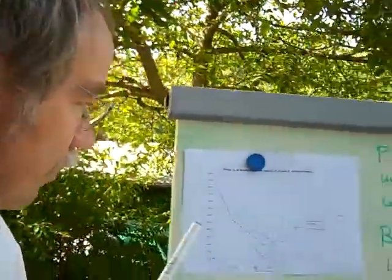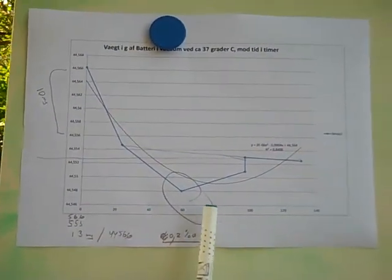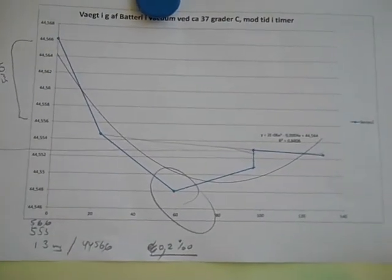These are not approved for space applications as it is, and that of course means that certain tests have to be done. The first test we did was very similar to our PCB — we actually put it into a vacuum chamber and kept it in for a certain number of hours.